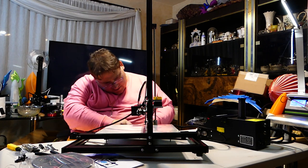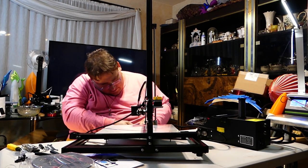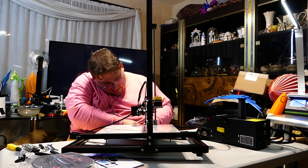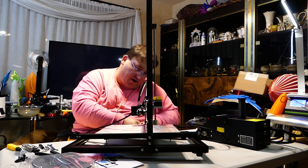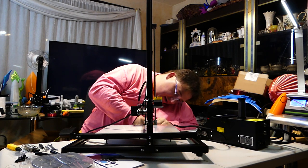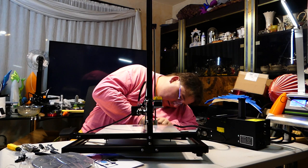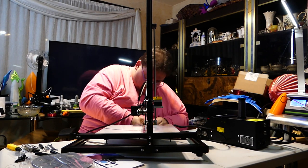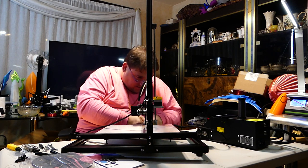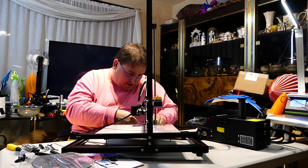Needs a little help, just stick a second wrench in there and make that hammer nut turn. There we go. And also don't tighten them all down too tight, because that'll prevent the other ones from turning. Just snug them. And when you see those hammer nuts turn, you know you got it. If you crank one down, you're going to bend the plate out, and that'll prevent the other hammer nuts from turning.